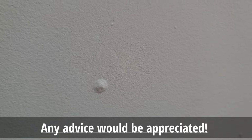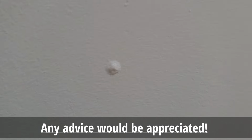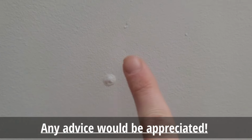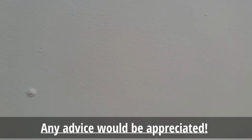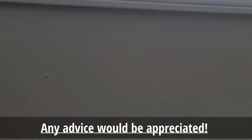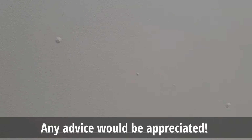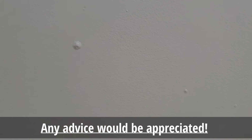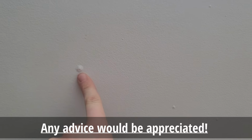Paint experts, please let me know what I can do to fix these bubbles. Do you see those bubbles in the paint? I have one spot in this living room, right under the window, that has these bubbles, and I fixed them 4 times. I scraped them off, filled them in with mud, painted over them again, and new bubbles form every single time. These are not the same ones.